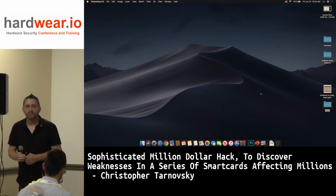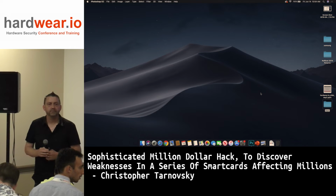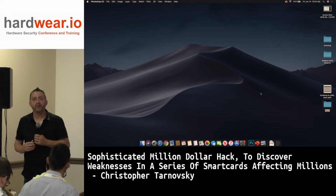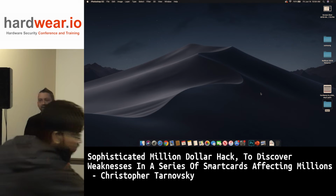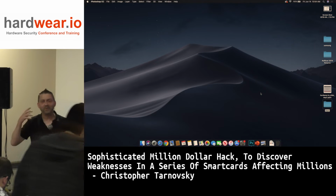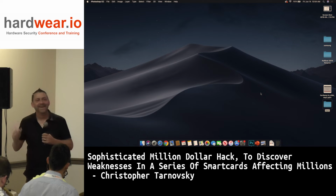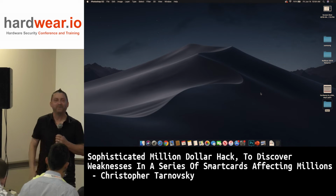Have you seen any interesting countermeasures in some of the recent chips? Samsung. The Samsung chip with the double flip-flops with the XOR traps. That was interesting. When I saw that, it really got me excited. My wife is like, oh, whatever, she doesn't care. I get all excited about this stuff. But yeah, the double flip-flops, I caught that.